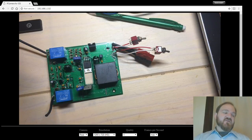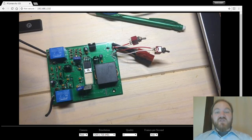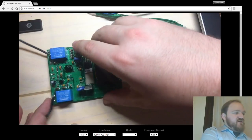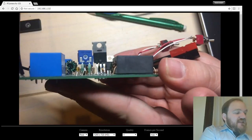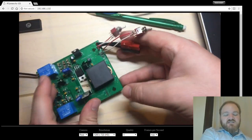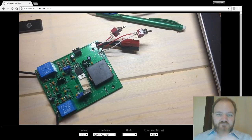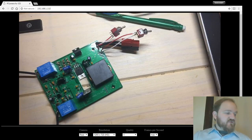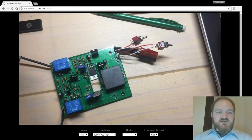I'm also going to make a parameter for a few of the mechanical details that I am going to reuse over the course of the design. So I think the first parameter that I'm going to create is going to be the distance between the bottom plane of the PCB itself and the bottom solid surface of the box. And we're going to call that PCB to bottom millimeters. We will give that a value to start with of 1.5 millimeters. Great.